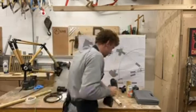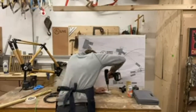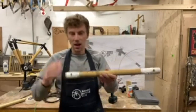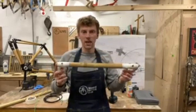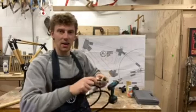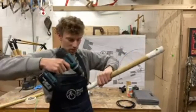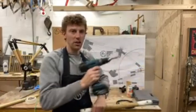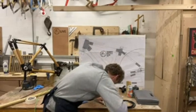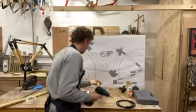You drill two holes first. Now, if the holes are drilled very straight it's going to be really difficult to get the cable in. So what I'm going to do is use that same drill bit to angle the cut — I'm going to go back into my hole and just add an angle so the tubes can come in softer. I'm going to do the same on the other side.